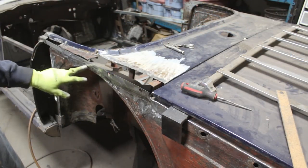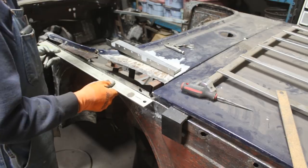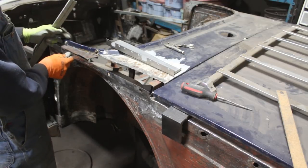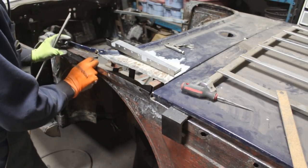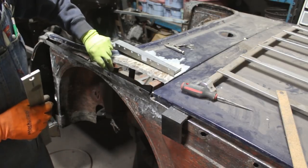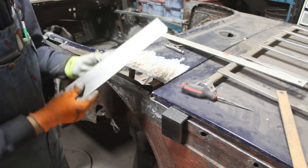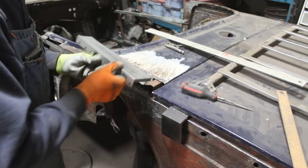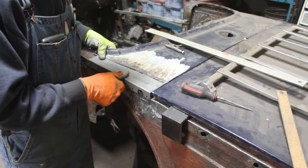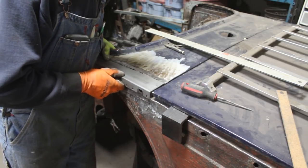So it's all welded and ground. Now it's pretty much a straight line — there's a little bit of a bump right here, but I'm not cutting that far. If I have to, I'm gonna push it in or pull it out when I'm attaching the outer piece, so I'm gonna make sure the outer piece is a straight line. I also ground this a little bit more because now this can go a little bit further. We'll take a step here and this goes nicely there — like that, and we're perfectly fine.